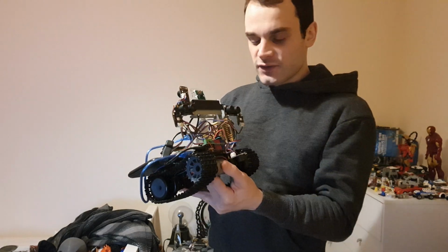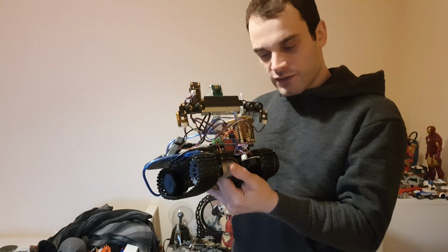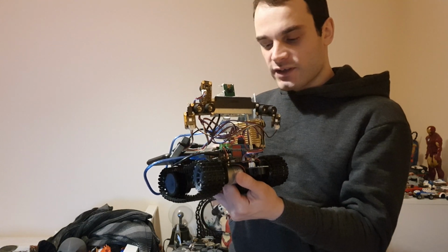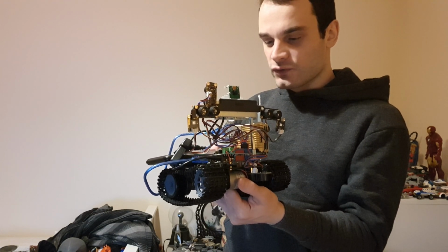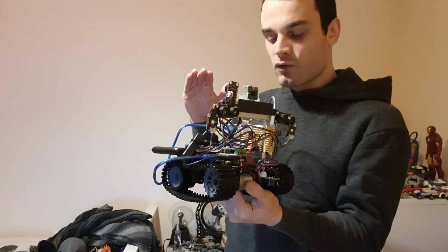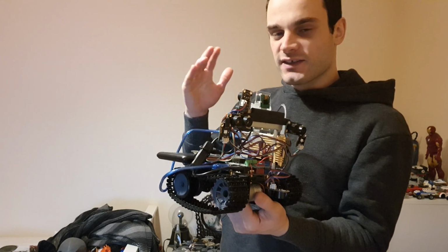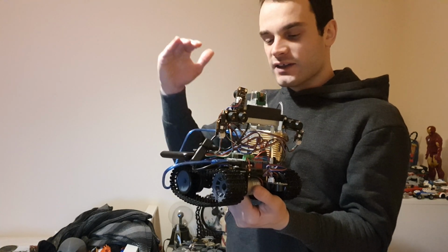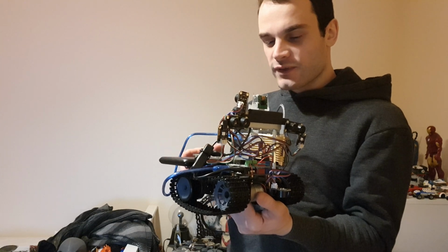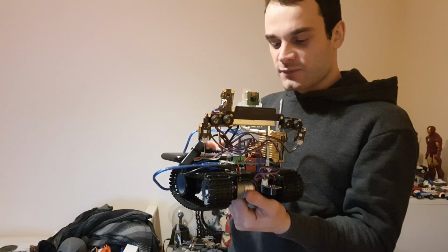So the HK software is a little bit more advanced. I'm working on the first iteration of an event queue, where essentially you have TTS or visual detection systems or movement systems or anything like that, all multi-threaded, all running at the same time, and when they want to perform an action, they send a request into this central event queue with a priority on it, and then the event queue works sequentially down through that, so you can have multiple things happening all at once without them having to single task.